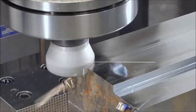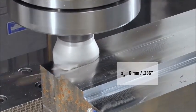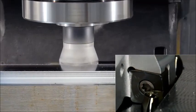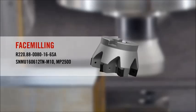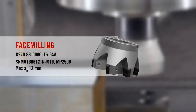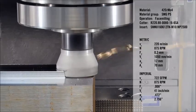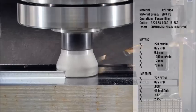You can see the good chip evacuation — the chips are coming out of the cutting zone and getting away from the insert quite well. In the slow-motion video you can really see the chip formation and how well the chip is curling and coming out of the cutting zone. By the sound it's very smooth. At depths of cut below 6mm for the size 12 and below 8mm for the size 16, you have that positive geometry and a nice smooth cutting action.